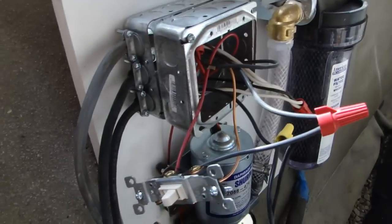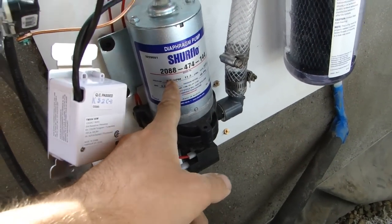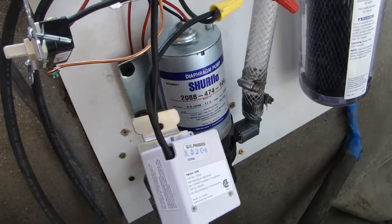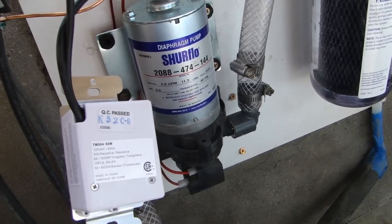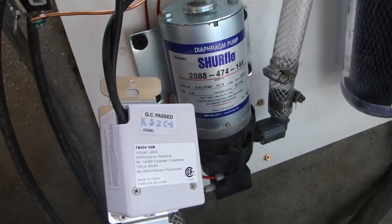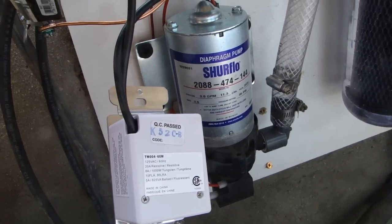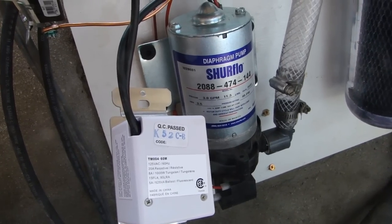This is an on-and-off situation. There's a pressure switch on this pump, set to be really sensitive, so that when the valve opens on the toilet to let more water in, it will sense a drop in pressure and kick on. As soon as the toilet valve closes — when it stops filling via the float flange — the pump will shut off again.